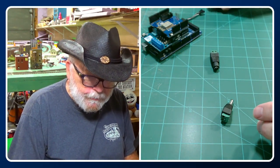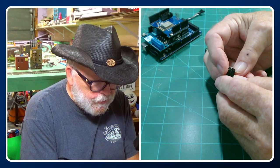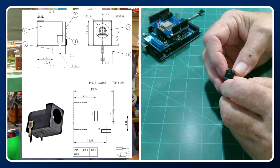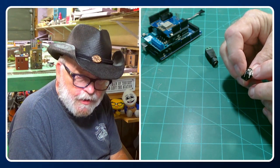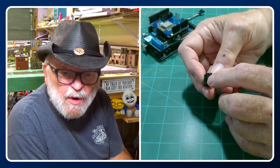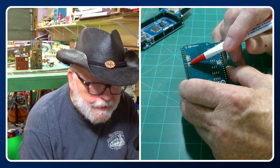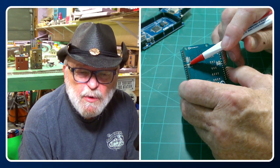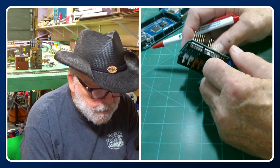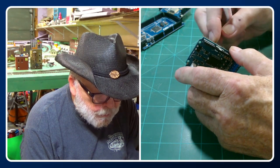What I ended up doing was taking one of these barrel connectors made for a PC board and soldering the wires right onto the two terminals. The one that goes all the way to the back is the one on the pin — that's your positive terminal; this is your negative terminal. When using an external power supply you're going to want to cut the trace between those two solder pads. If you're not comfortable doing that, you can also just take the VIN pin and bend it out of the way.